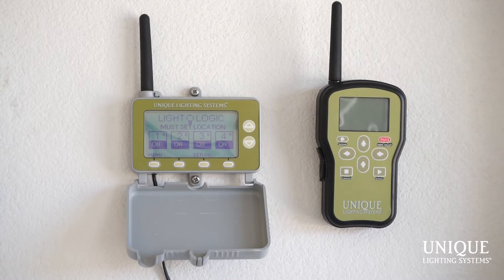Now we're ready to set up the LightLogic LPCUA on these transformers on this job. There are three components to LightLogic: the LPRO, which is the LightLogic Programmer; the LRMT, which is the LightLogic Remote; and the LPCU and LPCUA — Lighting Power Control Unit, and Lighting Power Control Unit with an antenna is the dash A.